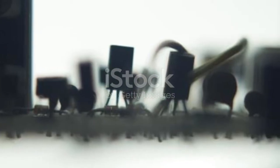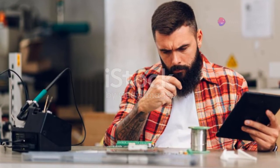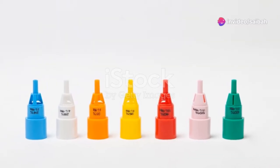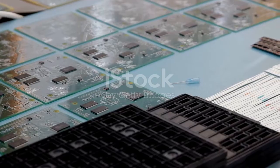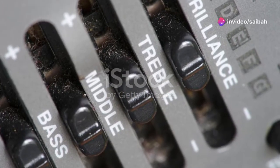Now, let's talk about improving noise immunity. Place capacitors from the positive to the negative signal and across the power supply. Use two values in parallel to filter different frequencies — this combo can work wonders. You can also filter the output by placing capacitors and resistor networks across it. Just remember, this will affect the frequency response.